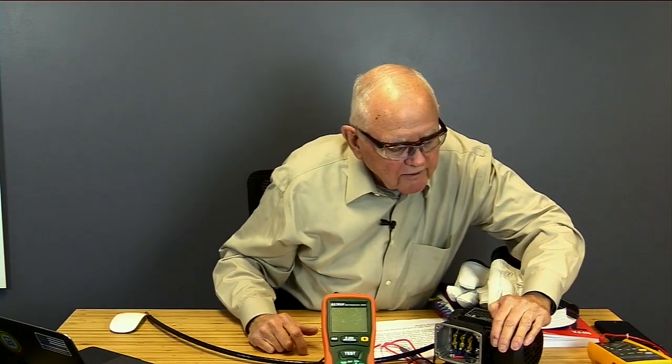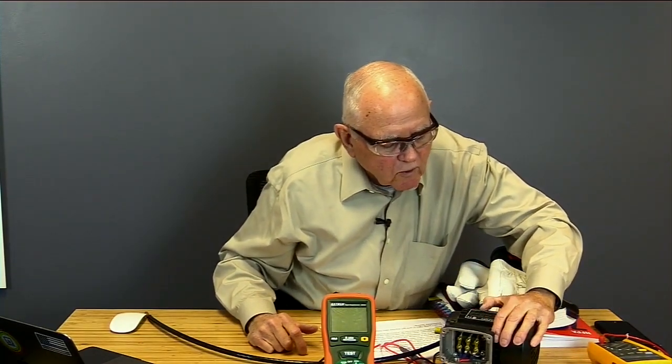Great, I did a great job. Then I turn around, pull that fitting off, start my hydraulic pump, and put 1,500 psi on that piping system. That'd be crazy. I want to test it at least at whatever my pressure is going to be, probably something greater than that. The same is true with electrical circuits. This motor is rated for what? It says 440 to 460 volts. So this motor is rated up to 460 volts AC.